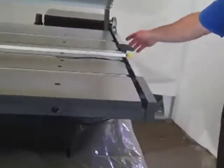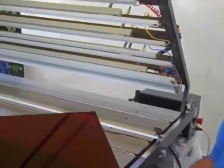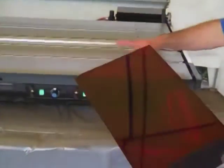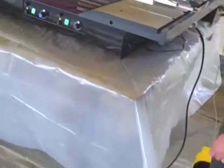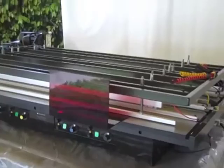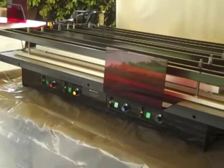Over here I've got my timing controls. I've got it set for 20 seconds, and I've already given the tray time to heat. I'm going to set my plastic and push my foot controls to bring the top down. It's going to go for 20 seconds, then it will sound an alarm to warn you to get out of the way, and raise up.